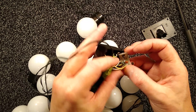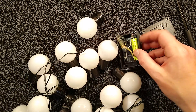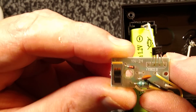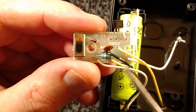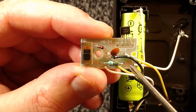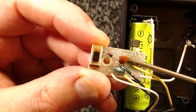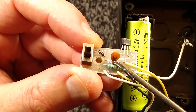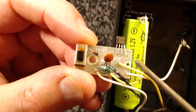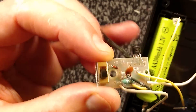It's the classic little — there's really not much to write home about here. Here's a close-up of the circuit board. It's using — it's even printed on it — the YX8018. It's got a 33 microhenry inductor, orange-orange-black, so they're already pushing that for how much current it can put out. They've got a 104 capacitor here — that's 100,000 picofarad, or 100 nanofarad. And they've got a little 1N4148 style diode being used to provide a stable DC output to the LEDs — it doesn't dip to zero, which means they could use colour-changing LEDs.